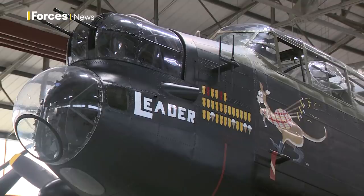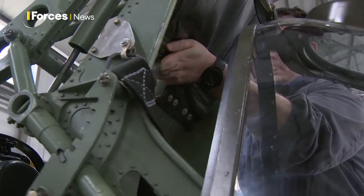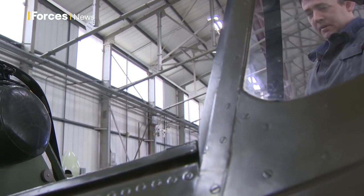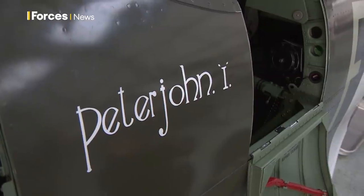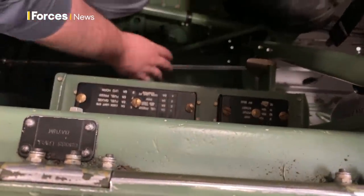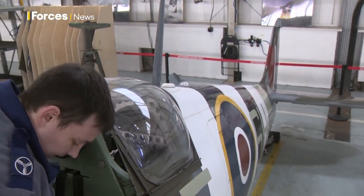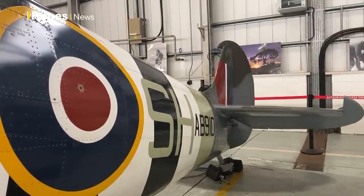With the Lancaster in waiting, the engineers can focus on the smaller jobs during this maintenance period — catching them early is the key before they become a major issue. A lot of the flying controls are cable; they run under the seat and all the tensioning locators for the cable are actually under the seat. The cables run in from your pedals at the front all the way down to the tail, and we're re-tensioning the cables and making sure they're at the right tension so they don't come loose.